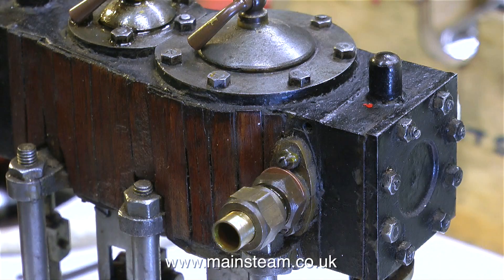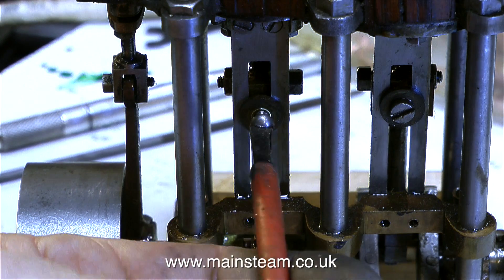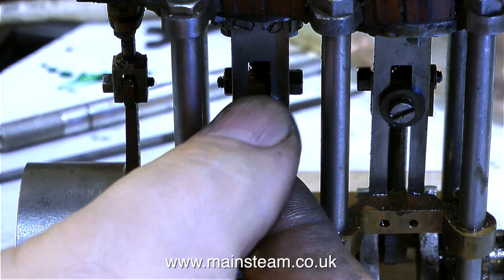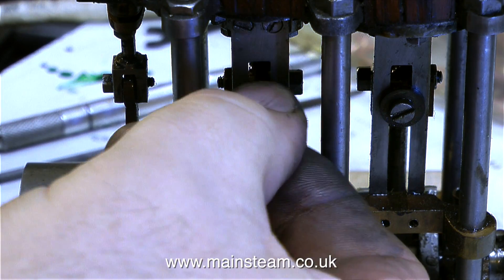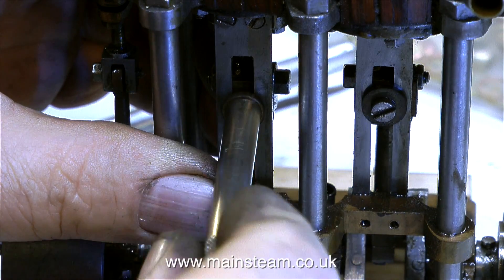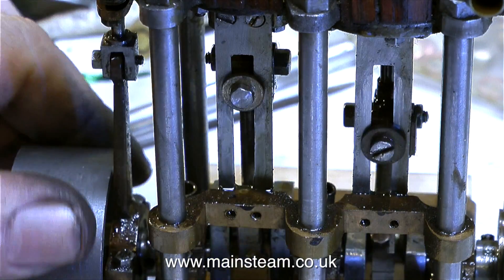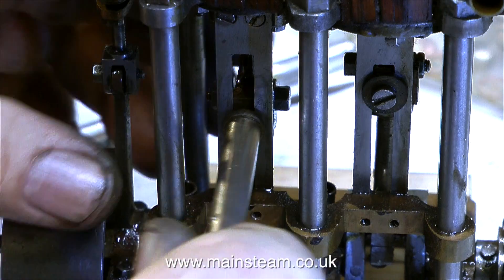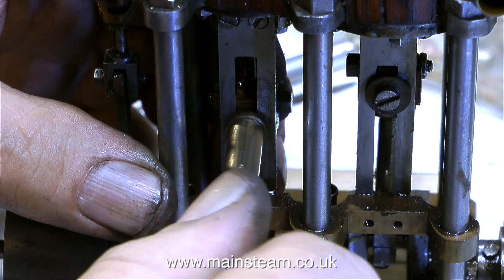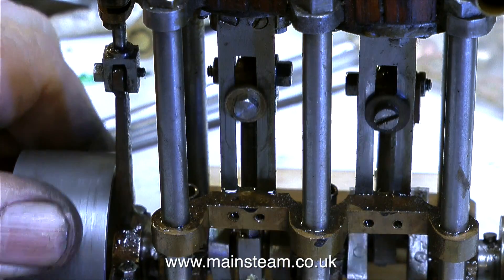These are very small jobs, but they're very accumulative. If you don't take care of them, it's very frustrating when you run the engine and there's steam and oil residue coming out from everywhere. The job I'm currently on with the engine is not really essential, but I could not live with a round head bolt in one of the crossheads and a flat head bolt in the other one. So I fitted a matched pair of 5BA bolts into both of the crossheads.